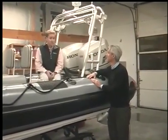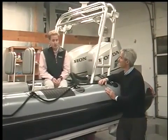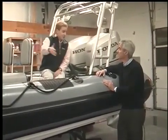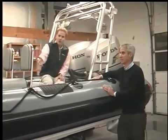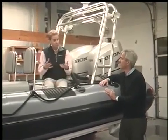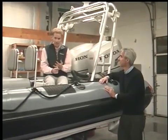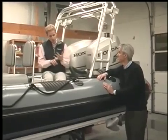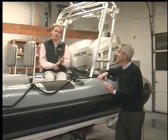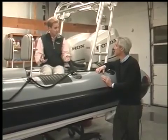So it's nothing unique about a RIB in terms of power — you can have the same power choices as a traditional craft. But what's unique about a RIB is that you gain a lot more speed than you would in a traditional boat. One of the main reasons is that half the boat is made up of an inflatable tube, so the sides of the boat aren't as heavy. The boat's a little more buoyant, it sits a little higher in the water, so you have less drag and the efficiency of the engines is far greater. You can end up putting less horsepower on the boat and get the same speed because you've got a lighter product.